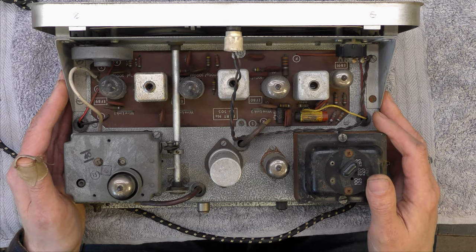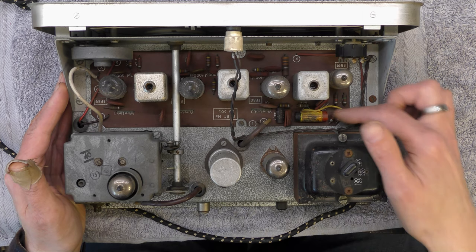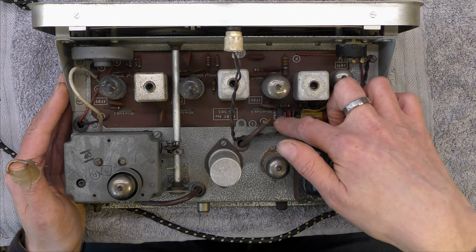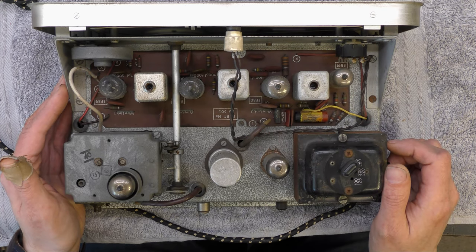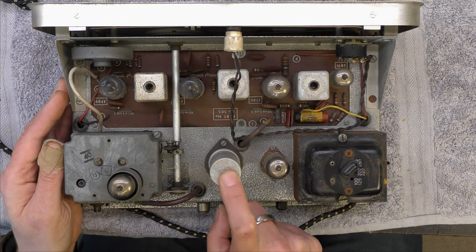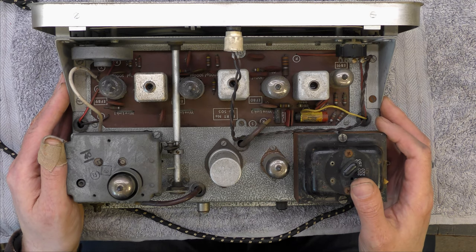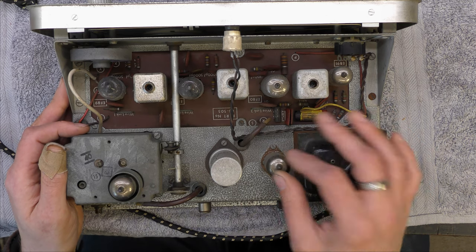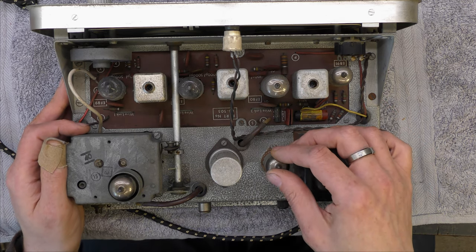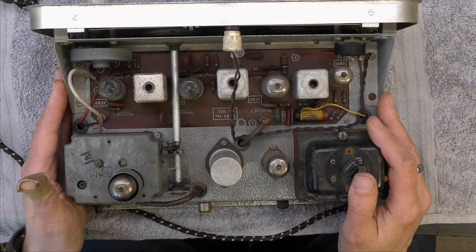But obviously I've got spares, so if it does turn out that something's open. Resistors as well. It's these carbon composite resistors. They're not always reliable. There's an electrolytic that'll need changing, and there's a Hunt's capacitor here. That'll need changing. Probably electrolytic, although it's a Plessey, made in England. Might change that. I think I might have a 50 microfarad dual section. That'll be right with the rectifier, which is an EZ80. I think that's about all I need to do to get it started.